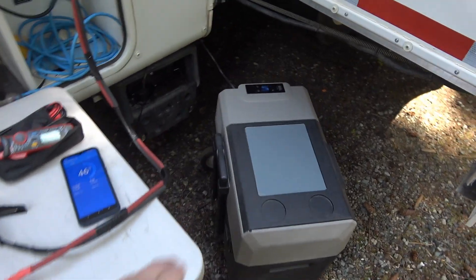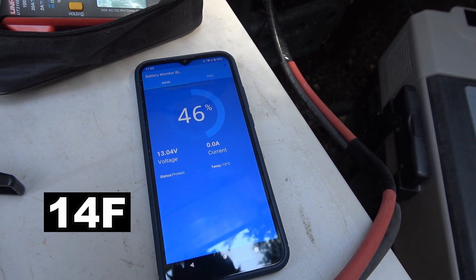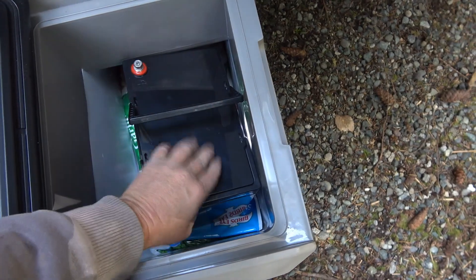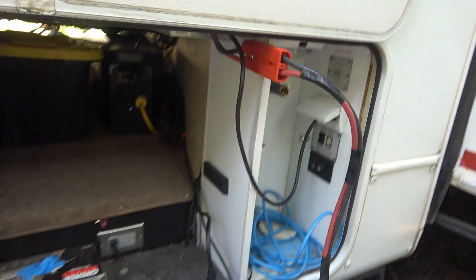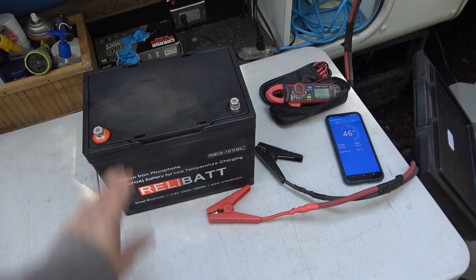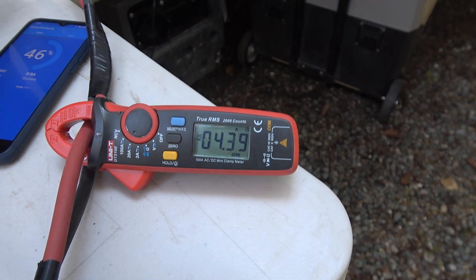For this test I've put the battery in overnight in my portable freezer. The app is reporting minus 10 Celsius right now and it says 'status protect,' so it's in low temperature shutdown. I'll pull it out of the freezer — see, it's been in there nice and cold. I'm going to hook it up to a converter charger I have that I use for my macerator pump. We'll see — the heater elements should draw about 4 amps and then it should start to charge after it's warmed up. There we go — it's drawing about 4.3 amps.